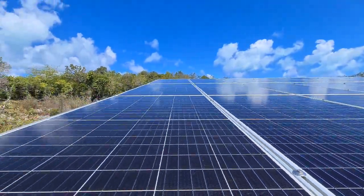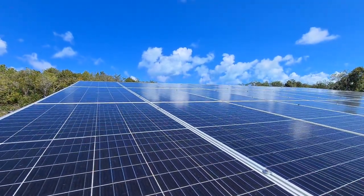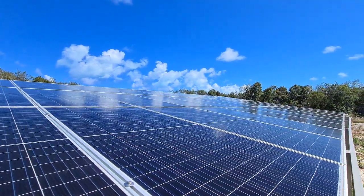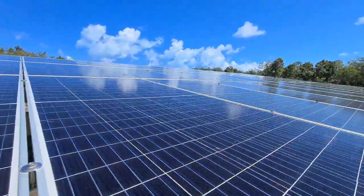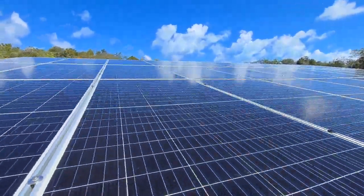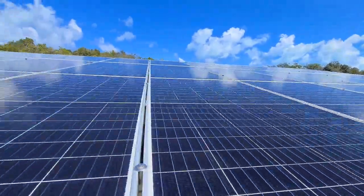We have our expandable solar system right here. As you can see, we have three rows of panels, 11 panels on each string. So we have roughly about a 14kW system right here. Beautiful. Now we're using monocrystalline solar panels — very efficient and very great. We have them in series and then parallel in one row, and they're looking great.